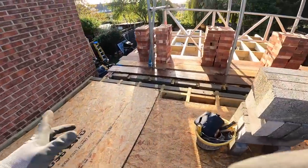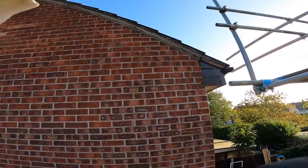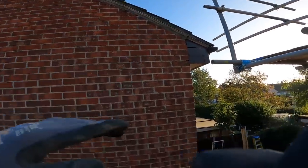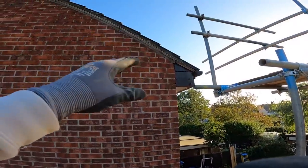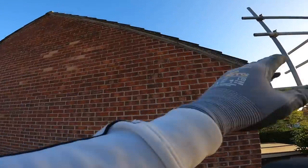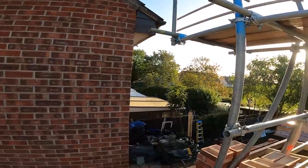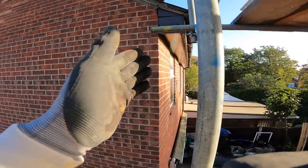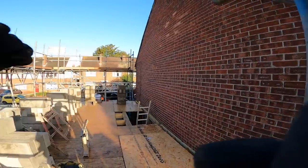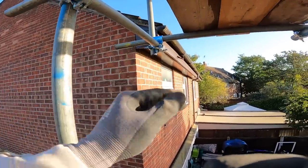But now I've got to get over, because obviously our roofs need to be in line with each other, so the roof trusses need to be back to where they was. So I'm going to have to bump this side back up once I get to the roof truss height, and the roof is going to be slightly out of level by about 40 mil from one end to the other. But I need to match what's there, because our brickwork needs to match. Even though my work would be right putting it in with a laser, it will look wrong because theirs was wrong, ours is right, but it will look wrong that we haven't copied theirs.